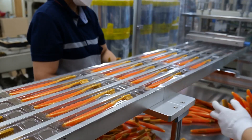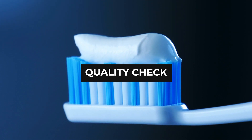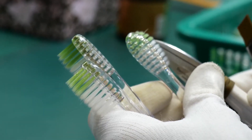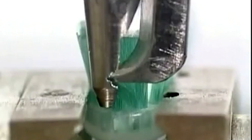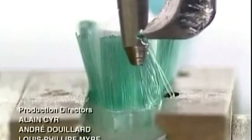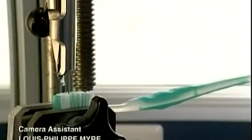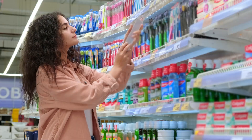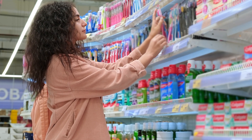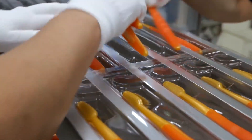Quality Check. The factory will conduct spot checks for quality assurance by pulling a toothbrush off the assembly line. A robot arm will pull on the nylon bristles to check whether they are correctly inserted and won't come out when pressure is exerted. After confirming that the bristles are secure enough, the toothbrush passes the check, and so does the rest of the production. These handy little dental tools are then cleared for sale, and the brushes are ready to be packaged and delivered to people.